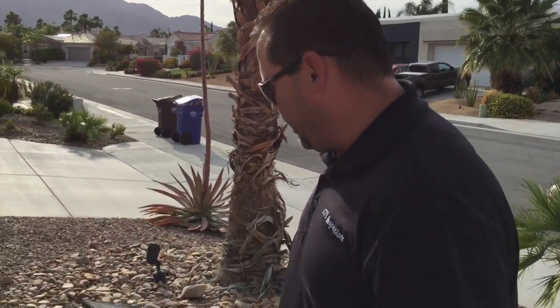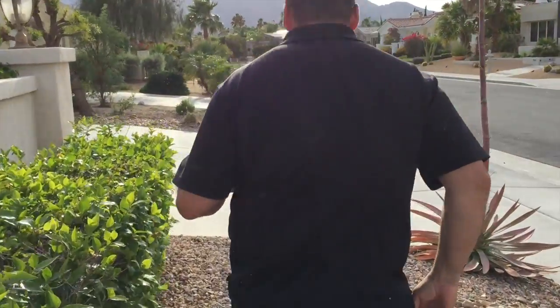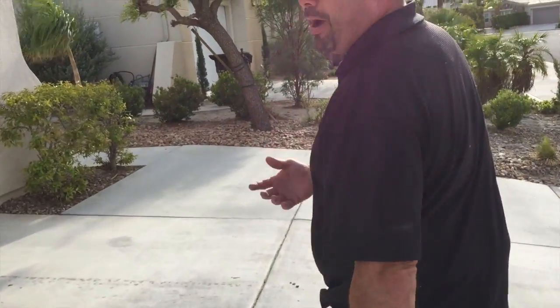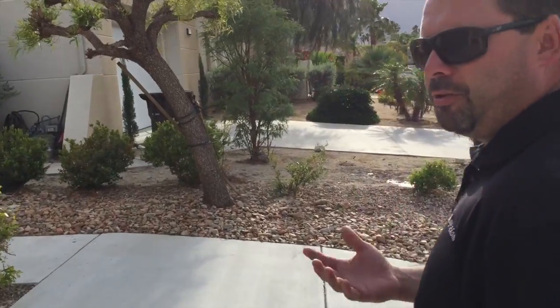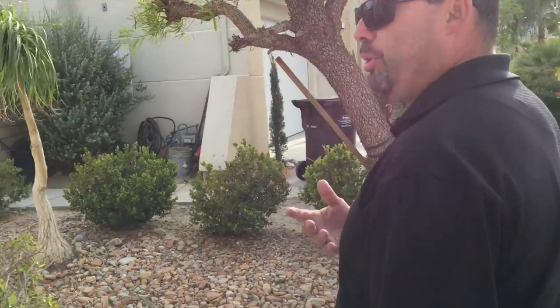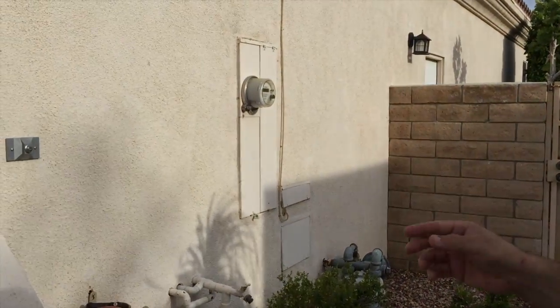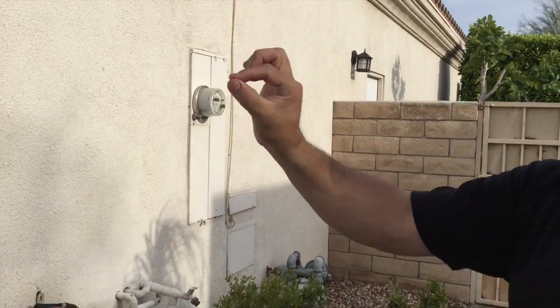Inside the electrical panel, which is on the west side of the garage. You have neutral wires, which are the white wires to an electrical circuit. When the builder put them in, there should be one wire going to each lug screw inside your electrical panel. There's a strip of screws, and there should be one wire going into each screw. What they've done is they took a couple of wires and put 2 wires into one screw. That's called a double tap neutral, and that's not to code.